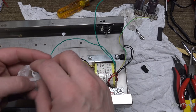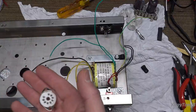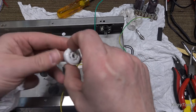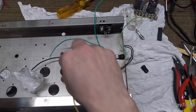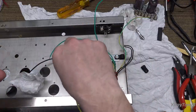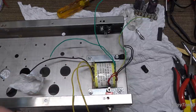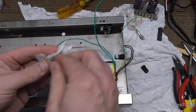I went into my stash and I have some chassis-mount sockets. The sockets that came with the amplifier are PC board mount type — you can see they're different. They don't have a mounting flange like the chassis-mount ones do, so you can't mount them directly to the chassis. The PC board mount ones are meant to be mounted on a PC board with standoffs. So if you want to do point-to-point wiring, remember you'll need chassis-mount sockets.